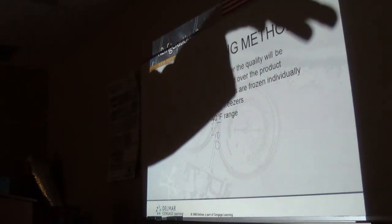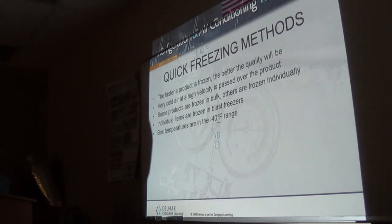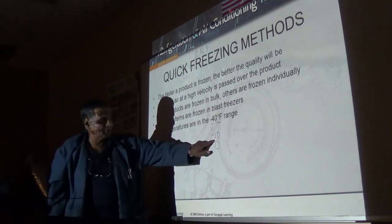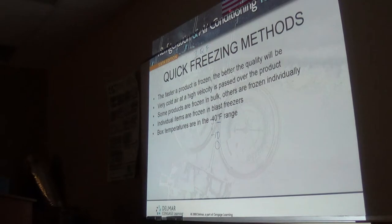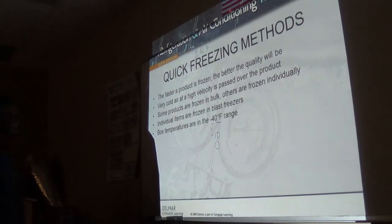Nobody allows these compressors to work in a vacuum, because they're positive displacement compressors. So there's no way they're going to allow that to happen. They can hold zero without going into a vacuum. To get close to zero, you may be somewhere in the region of 1 PSI, 3 PSI, very low, which is very close to being in a vacuum. But it's not.